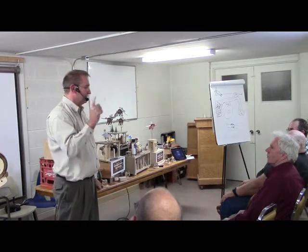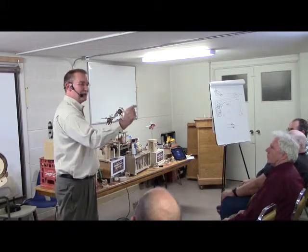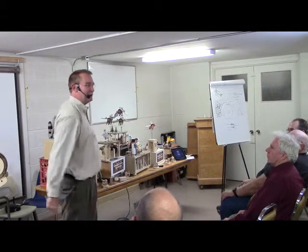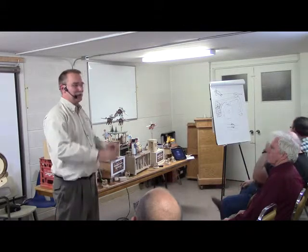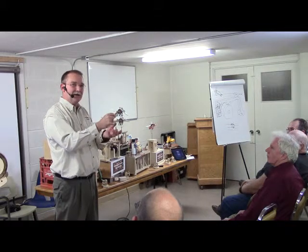And never, gentlemen, never ever use CA glue out of the bottle, because you know someone's going to open the door and you're going to be scared and squeeze all the CA glue out at the wrong moment in time and glue the whole thing together. So put it on a wooden stick or a piece of brass rod and dab it in there.